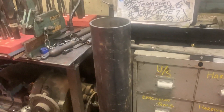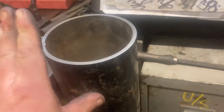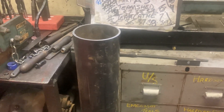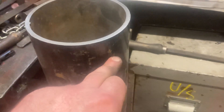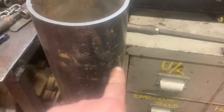The first thing is a very quick bit and piece that I picked up on the way into work this morning — that's this length of steel tube. This is to make up some cores for casting rod brasses, of which we're doing quite a lot. The problem is the old cores have got very badly pitted on the outside — there's been one or two stuck ones I've had to machine out. So this piece of tube has been bought so we can make up a couple of new cores.